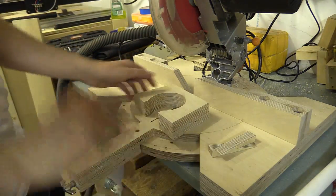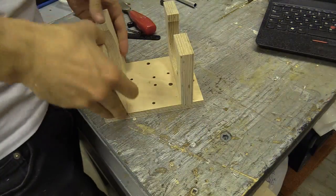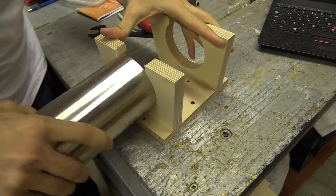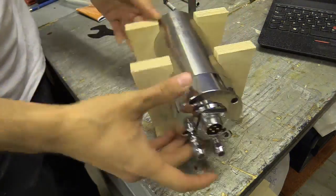These mounting plates fit nicely into the channels, and when the spindle is slid in place this should hold everything square. I have already tested whether the lead screw can take the weight of the new spindle by balancing it on the Z axis of my old machine.